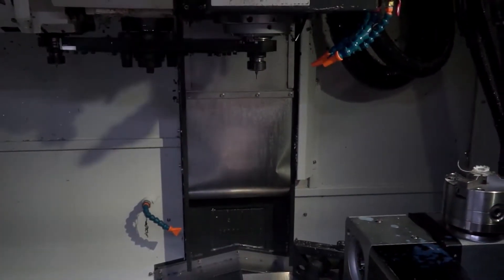And it's a Big Plus spindle as well, isn't it? It is, so that can help us with our tool holding — obviously more accurate on a Big Plus tapered tool holding setup. Good machine.